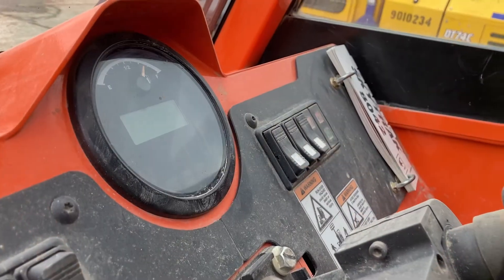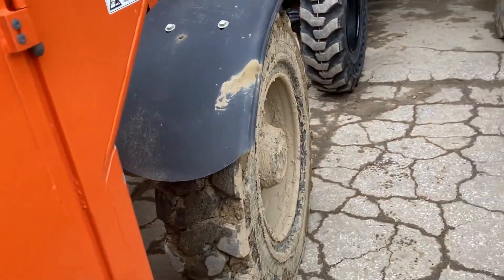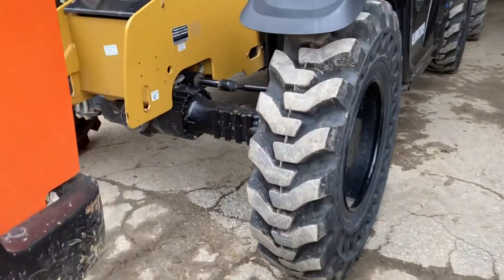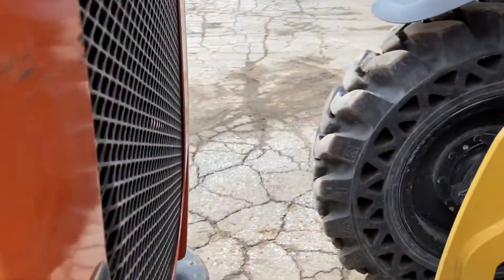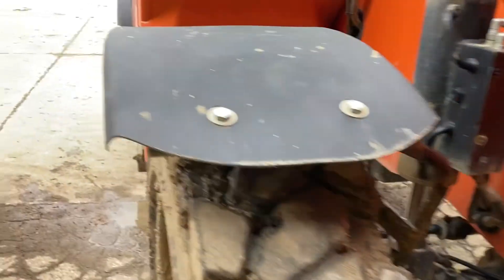A quick way to check it is to walk down to the back of the machine. The coolant sensor is located in the coolant reservoir behind the rear door, up in the top right-hand corner. If you unplug it and go back up front and turn the key on, you'll see if the code changes. That will tell us the condition of the sensor — if that's what's actually shorted out causing our problem.